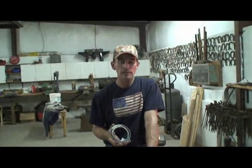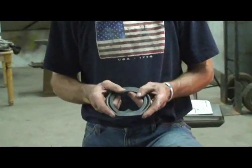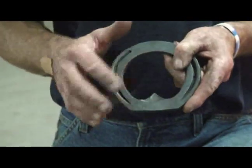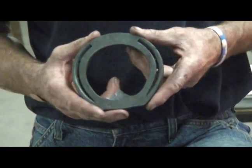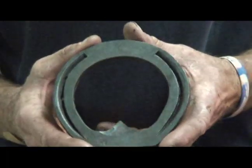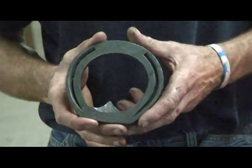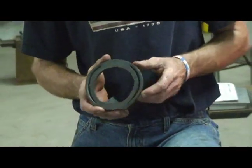Basically you can't get into every aspect of bar shoe building, but we tried to hit on two things: having your branches come in at the same angle as the foot, and having a good solid weld and using your frog plate to shape the back half of the shoe. Once you own the basic principles of all the facets of building a bar shoe, you can never lose it and you have ownership. We'll try and hit on more basics in the next video. Don't forget to not brush off breast cancer. Thanks a lot.